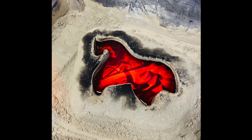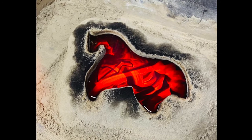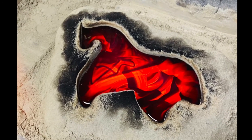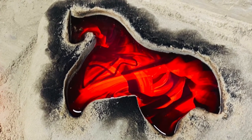Here is the horse after it was poured. I used a specialty red glass that created these beautiful patterns which I wanted to show you. The mold was filled up — that took about two ladles to fill that mold.